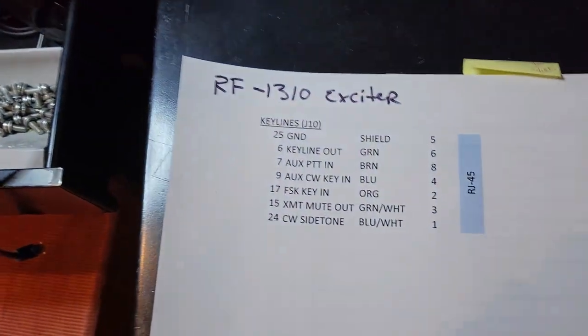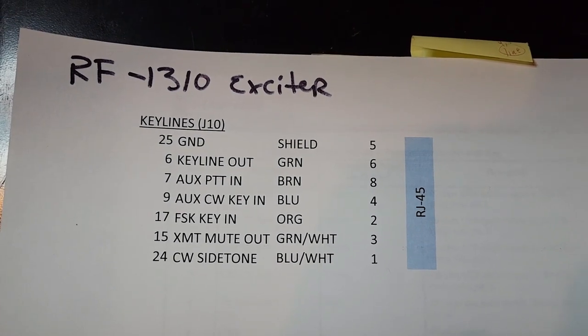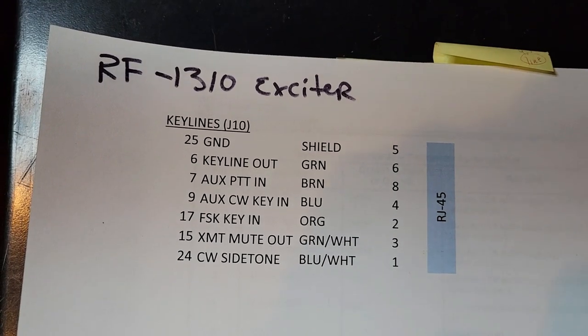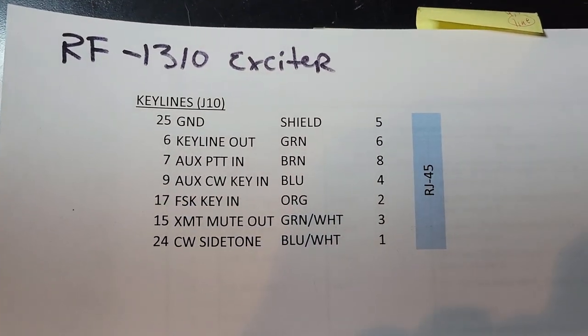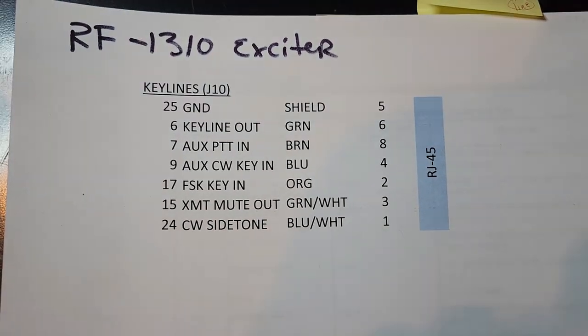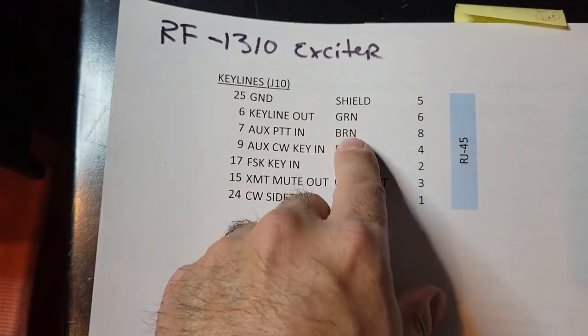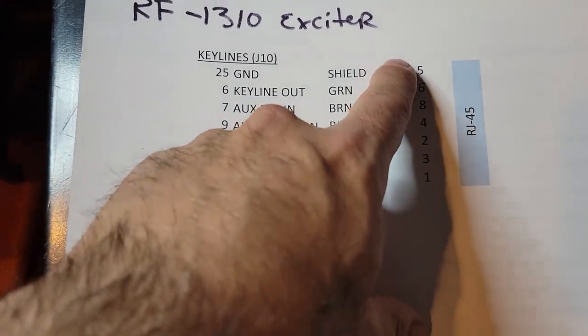So here are the key lines of the exciter. Not only does the exciter need audio, not only does it have RS-422 for the remote to control it, but it also has certain key lines and important control signals. So let's go through them. Ground, I think, is obvious. This is just some wire net lists, wire lists, so I know I can trace everything through, and pin numbers